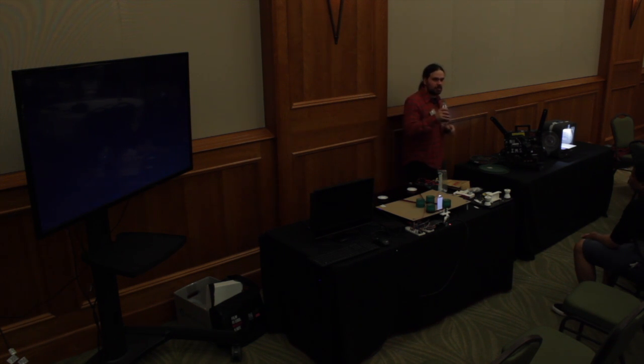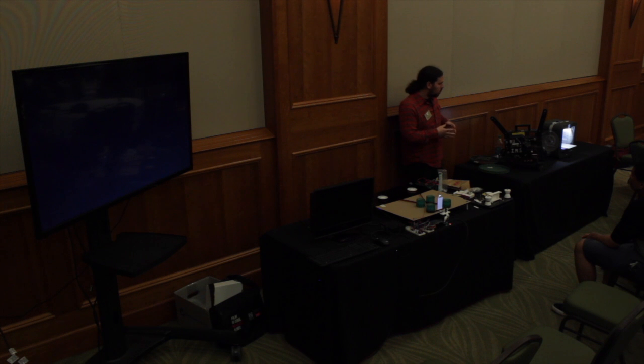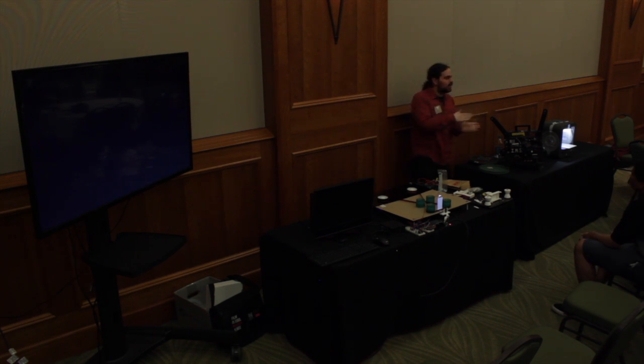Do you guys do some 16 millimeter production here? No, all digital. Okay, so usually the way it was done was that you'd have a field recorder, and you'd use what's called a crystal sync camera, a camera whose motor was locked in at 24 frames a second. That's why you have that slate that actually closes, so you could match up the audio track with the film. So you would record it on a magnetic tape, and then there's a machine to take that and actually produce the soundtrack.